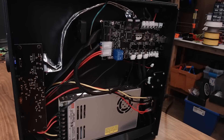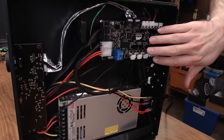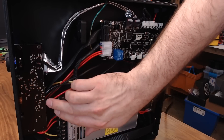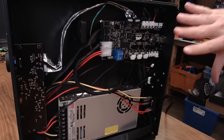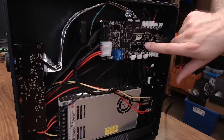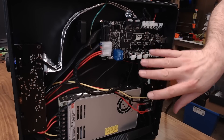Here's a look at what's underneath the machine and all the guts. They do use a 24 volt Meanwell power supply — that's a good sign. They have a proprietary board with ribbon plugs that connect out to different parts of the printer, and a proprietary LCD screen. The firmware is definitely proprietary and not open source. One big thing I noticed about the stepper drivers: they are not adjustable — no potentiometers to adjust any of the voltages. Not the most user friendly design.